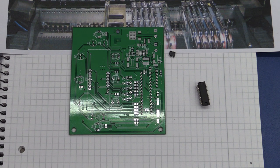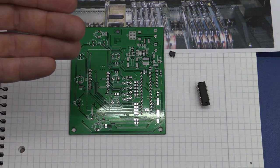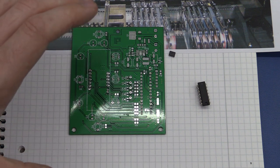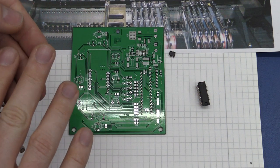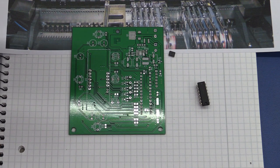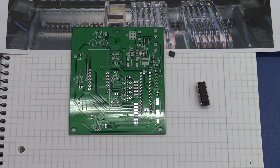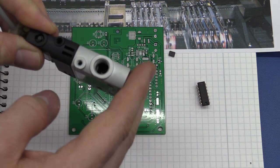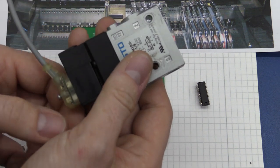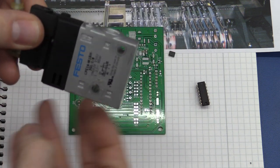I could do this just by turning on and off the pump with some kind of a relay or a MOSFET. Depending on how long the tubing is, that might be possible. But on the other hand, I could make a tank, and I could just pressure regulate the tank, just let the pump run and remove the air from the tank, and then use a valve, something like this, to open and close it. Just not this particular one, because I bought the wrong one. This one actually needs a pressure to operate the valve. I didn't think about that. So not this one.